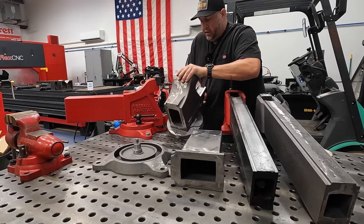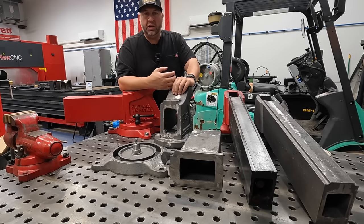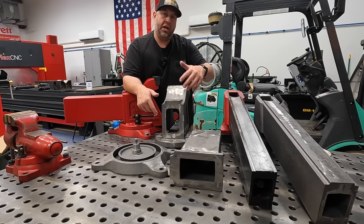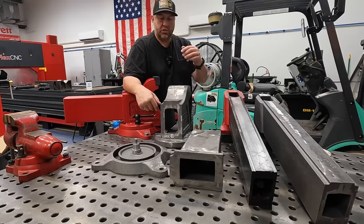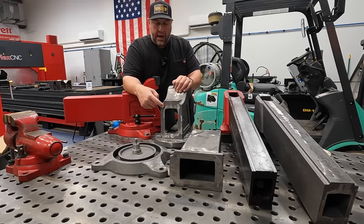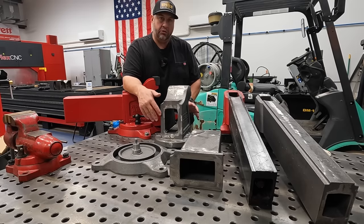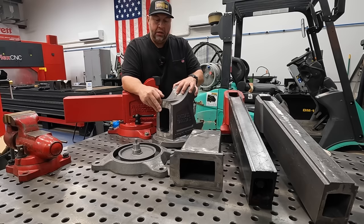And I think that is where we're gonna make use of our Genie shaper to get in here and cut the internal rectangular shape that we're gonna need for the dynamic jaw to slide through. And I do know that this process of getting this rectangular shape accurately machined in there was one of the big holdups for the Made in USA Vise.